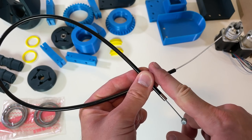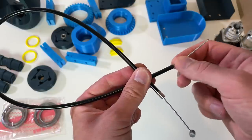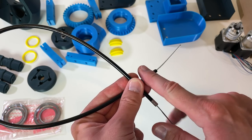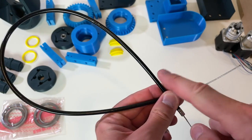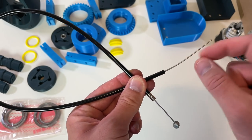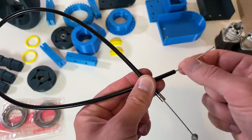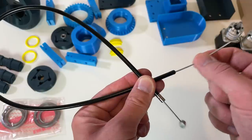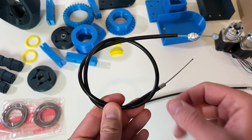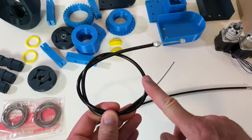This is a Bowden cable I'm going to use — a standard bicycle Bowden cable for the brakes. As you can see, like this it works perfectly fine. But it's not so obvious that it's going to work fine for a robotic arm. When there is a lot of bending in this Bowden cable, the friction in the cable and the housing becomes quite important. Here with a straight cable it's very easy to slide it in and out with very little friction, but when there is a lot of bending it's already quite difficult to pull and push it. So this is potential problem number one.